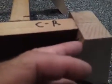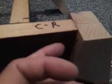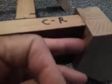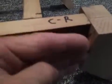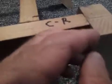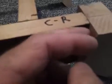But make sure you don't fill up the bottom of the hole too much, because when you go to hammer the dowel rod in, you should be able to see the bottom through the glue. If there's too much glue, your dowel won't go all the way in, because the glue has nowhere to go, so it acts the same as if there was a piece of wood stuck in there. Of course the dowel rods are fluted, so hopefully any glue that might get trapped could come out there. But I would just make sure you don't overfill the hole.